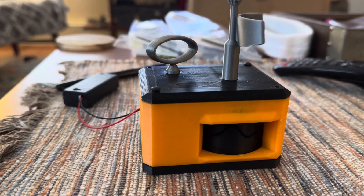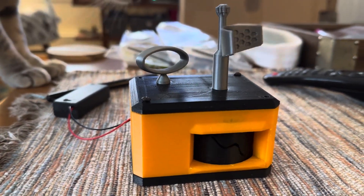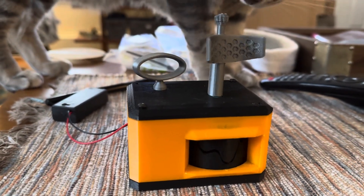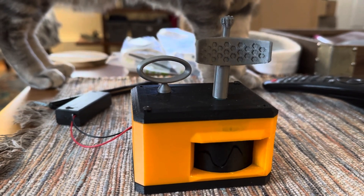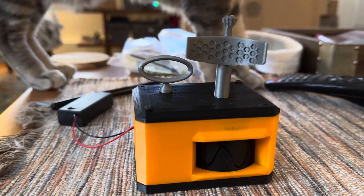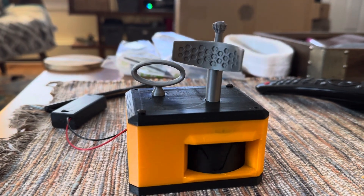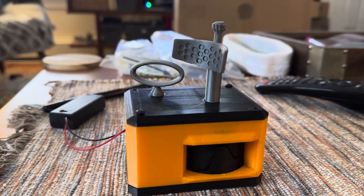What's happening inside is the gear that's rotating the main antenna has a cam with a pin, and then an arm sliding over to that other one, which has an arm on it, and that cam causes a reciprocal action on the smaller antenna — the secondary antenna. The secondary antenna, of course, you can aim in any direction — any of four directions.